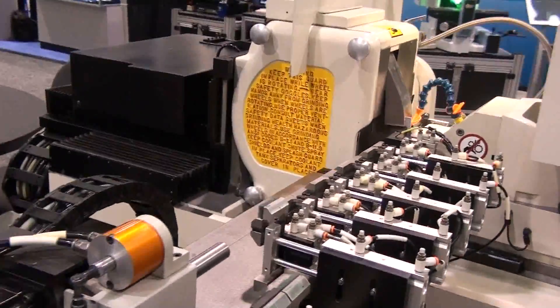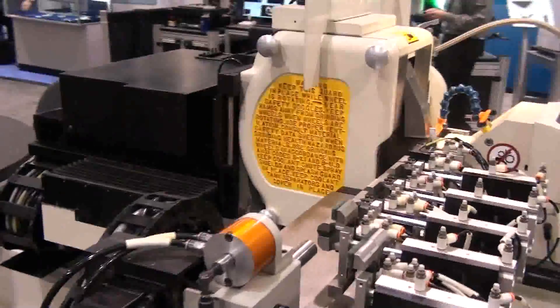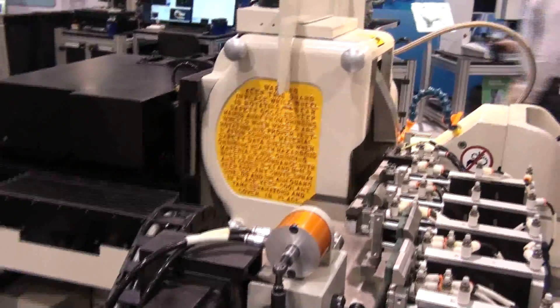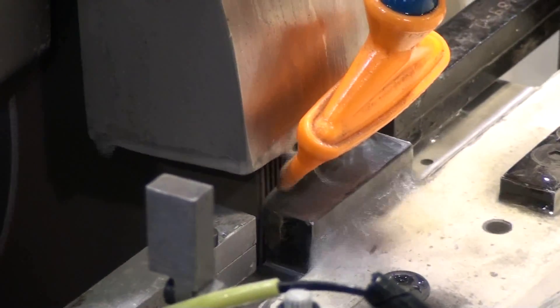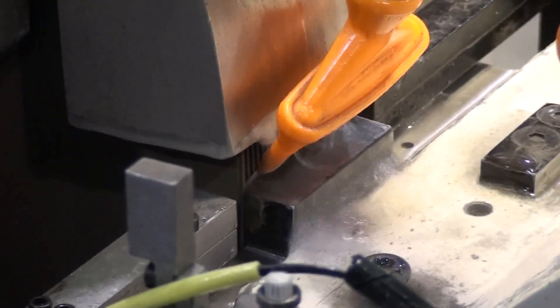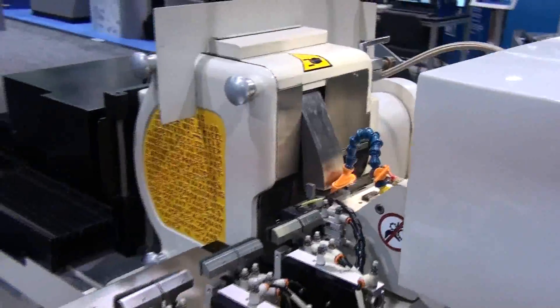You can spin, rotate, pan, and zoom on your part for details. We have an improved automatic feeding system and we can convert to conventional centerless grinding. Programming a CNC machine has never been easier than importing your 3D solid model to define the part shape and use the new part wizard to translate that into an Excel sheet recipe.